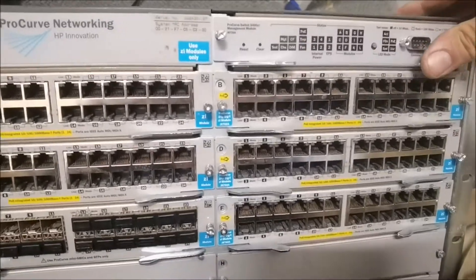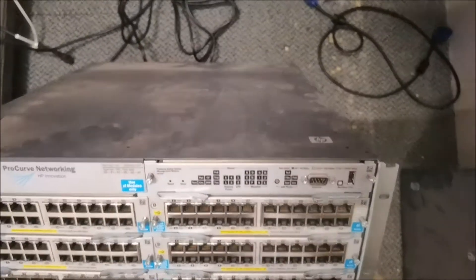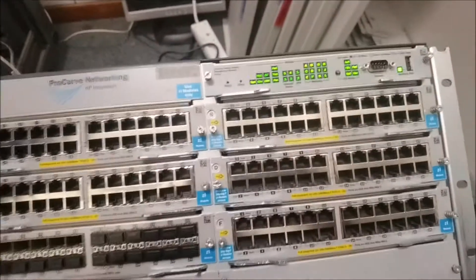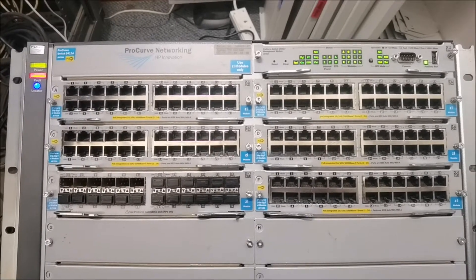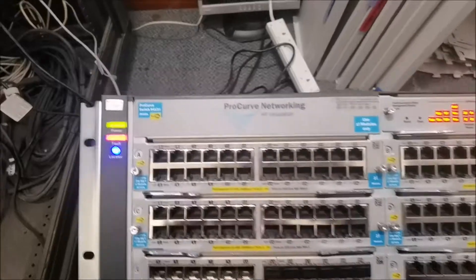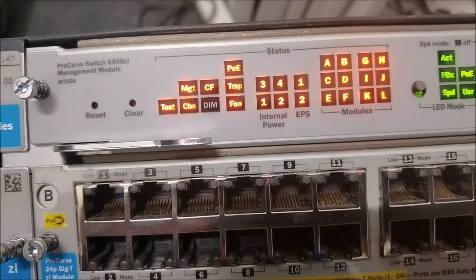Make sure that goes home. All the modules are back in. We're firing it up — and there we go. It shuts down. We get a fault light flashing and we also get a DIM error. I'm going to power it down and try changing that DIM first.